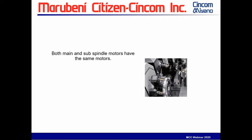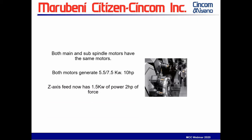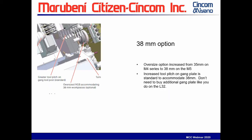Something else of significance is that the main and the subspindle motors are now the same motor, so they generate the same horsepower, up to 10 horsepower. Rotary tools in the gang post also have their power increased. It's doubled from previous generations, now 3 horsepower in the gang tool post. Z-axis feed is increased, 2 horsepower force, so you get more thrust if you're doing some heavy duty drilling.